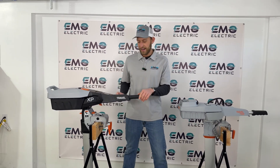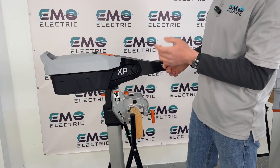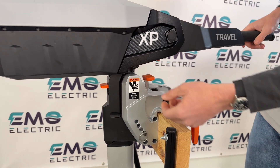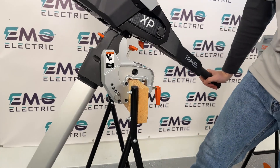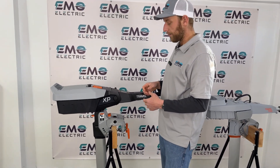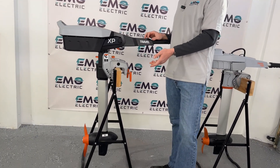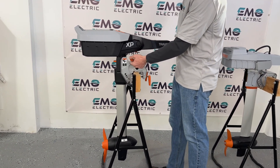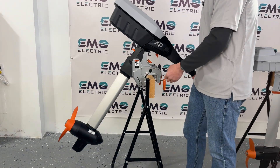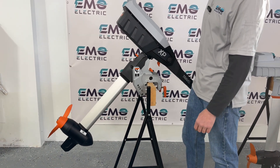On the new motors, that's been solved. To lock or unlock the tilt, you simply pull a tab up — when it's up the motor is unlocked and will pop up if you hit ground; when it's down it's locked. If you're in shallow water and want to raise the motor just a little, you lift the tab and push down on the tiller, stepping through multiple shallow water angles progressively.